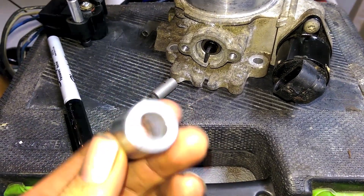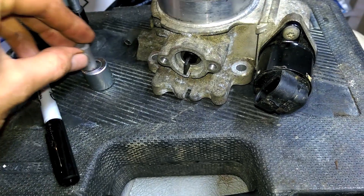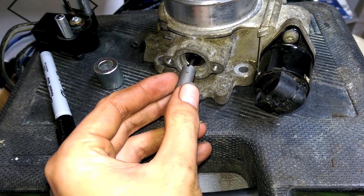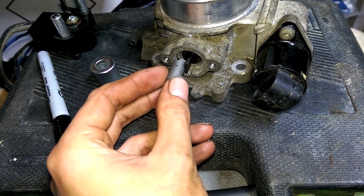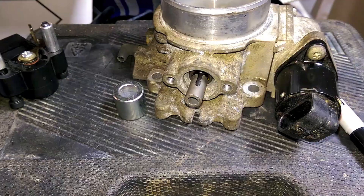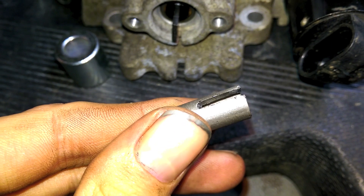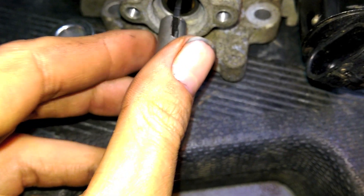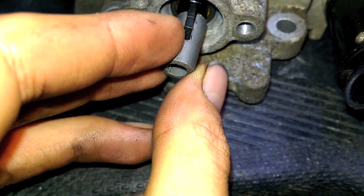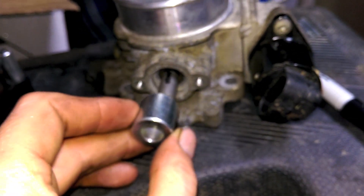This thicker bushing fits over that just fine. The inner part that sits in the middle isn't very tight, but this is where we cut the split into it. Using a grinder and a Dremel — step one complete. Grind a flat in there and it's damn near perfect. It's a little loose on one side but very tight on the other, and it goes all the way in.